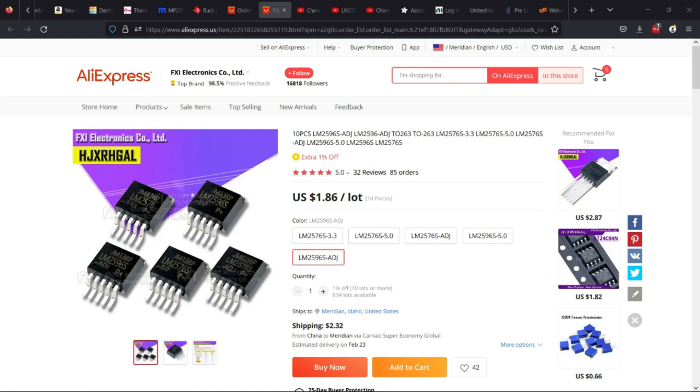In order to do this, we will have to build a little PC board, because we are not going to be able to plug these into a breadboard on account of the feedback, and there is potential for oscillations, and we need to filter out the higher frequencies that it generates, and so on, such as ripple. So a PCB is a necessity here because it is part of the circuit. In any case, I thought we would attempt it and see how hard it is to actually do that, and we can compare our results with some of those Chinese boards that have these things on them as well.